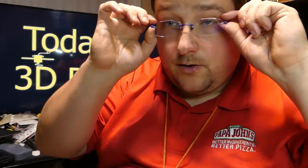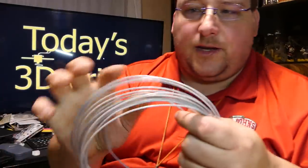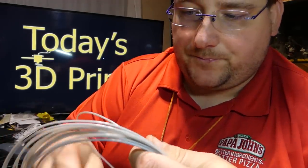And then when I was getting ready to start the fourth retry, I reprimed the printer, because there was always a little oozing plastic, so I squeezed the feeder lever, and I pushed plastic in, and two things happened. One, I pushed a lot of plastic in. I mean, push. I was like, what the hell? And then I realized I was feeling teeth marks on the filament, like 8 inches of it. And I was like, why? The filament is smooth.